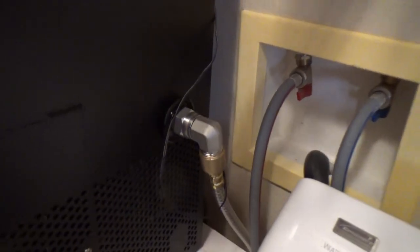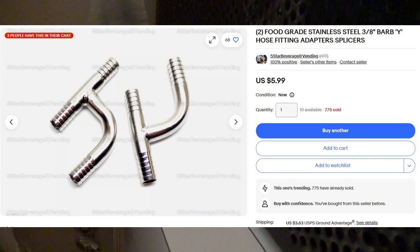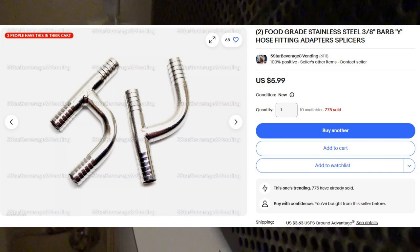There's therefore no assurance, or complete assurance, of not getting any water accidentally sucked into the chamber from your bucket. I've eliminated the bucket on mine by using the drain. I have this set up in the laundry room. There was a drain for a future sink, which isn't being used, and now we're using it for a direct drain. I've got those two J valves there, or J fittings, so that there's no possibility of sucking water up out of the drain valve.